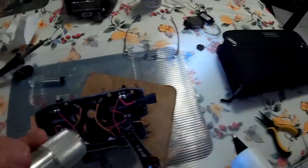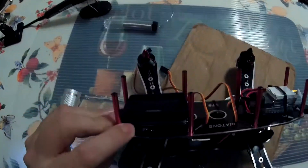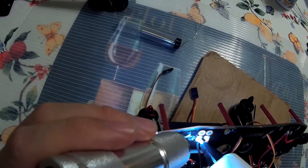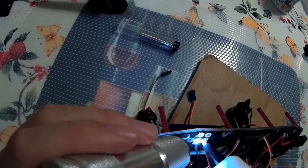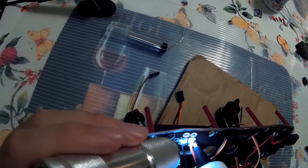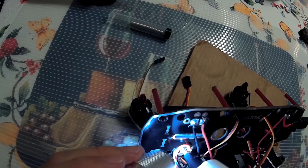Since I was about to put the hot glue on, I decided to flip the cables — instead of going from down up, I made them from the top to the bottom. That way when I flip it, I'm not having to twist it. Let's go ahead and start with some hot glue. I'm just going to dab some very carefully around here. The hot glue is going to protect from moisture, and whenever that cable gets pulled or pushed, all the strength and weight is going to be on the hot glue and not on the solder itself. That's going to be a big help to strengthen this up.